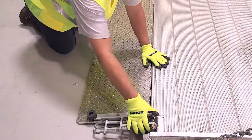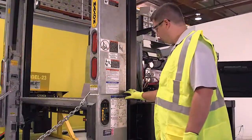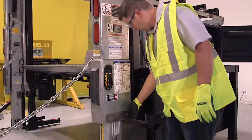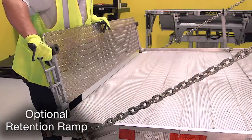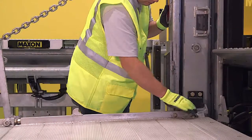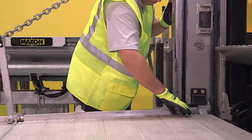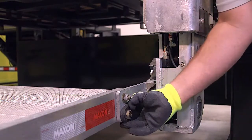Check for signs of physical damage on ramps, platforms, columns, runners, and hydraulic tubes. Check for proper operation of cart stop or ramps, if equipped. Check for loose or missing nuts, bolts, covers, roll pins, screws, and pins.